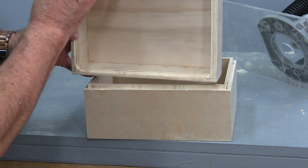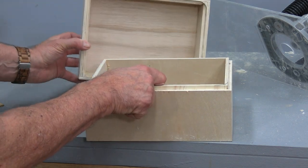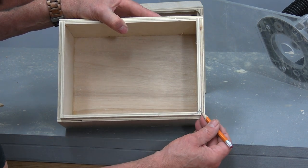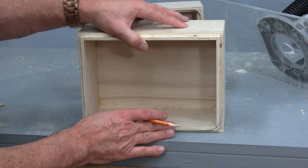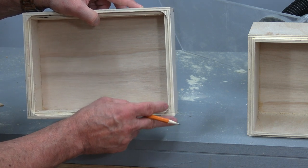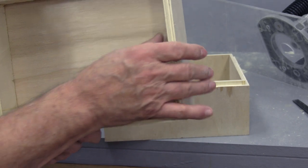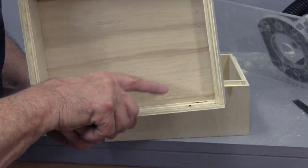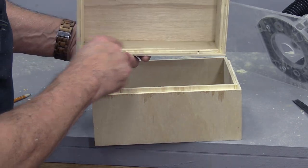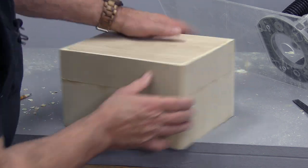Here's why: on the inside you can see there's a curve in there, but on the outside it's not curved — and that's where the curve would be on the inside, as I've marked. I have a couple of options: I could sand that square part off, or I could take the lid and use a chisel to carve it out. I used a utility knife — easy as anything. I discovered the cores are very soft inside, which reminded me this is not Baltic birch but some other brand, which is why it's blowing out. But let's see if it fits now — perfect!